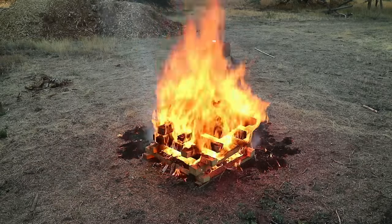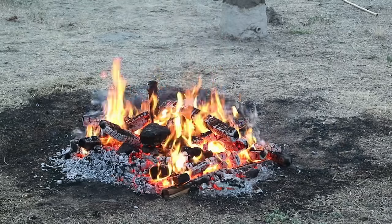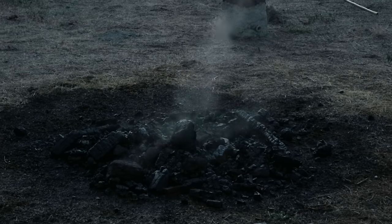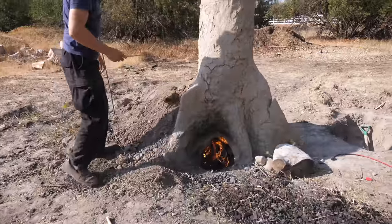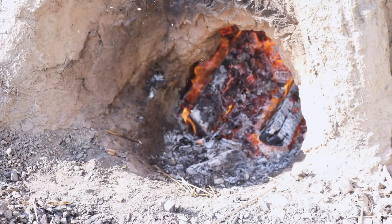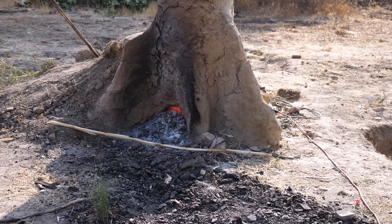One other thing they've done to prep is what's called roasting the ore — you literally take the ore, put it on a fire, and heat it up. It burns off a lot of the impurities like sulfur. It also weakens the ore by putting tons of micro-fractures and stress into it, making it easier to grind into small pieces for the smelt. More surface area means more contact for the carbon monoxide to bond onto, rip off oxygen atoms, and leave you with elemental iron. When smelting, the carbon monoxide produced by the fire combines with the oxygen and strips it off the rock. Getting sulfur and other impurities out before smelting makes it much better. Crushing the ore after roasting it — those two steps are a really important component of the smelting process.